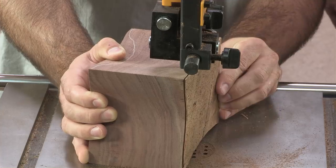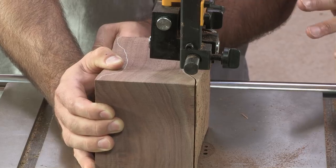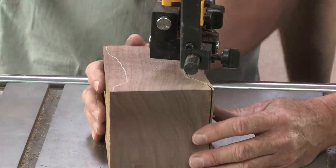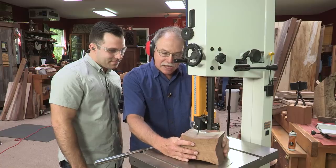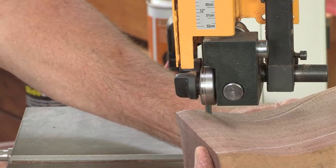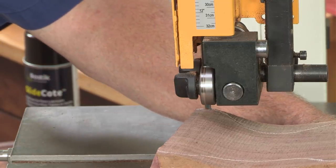Anticipate that drift a little bit — give that blade a chance to finish its cut before you make the turn, by using the side of the set to walk around its curve. Let me show you what I'm talking about. It's okay to tweak that blade sideways a bit — you want to catch up, and then you can walk right around.